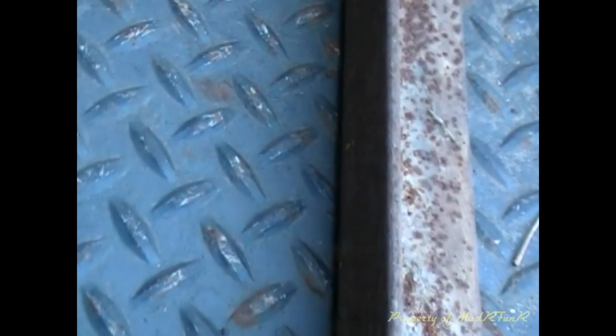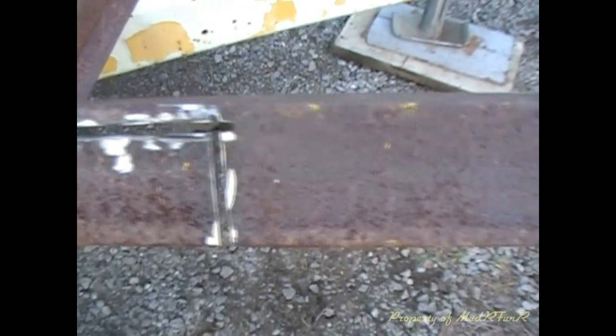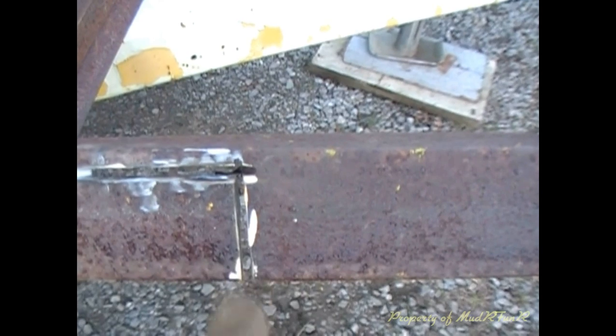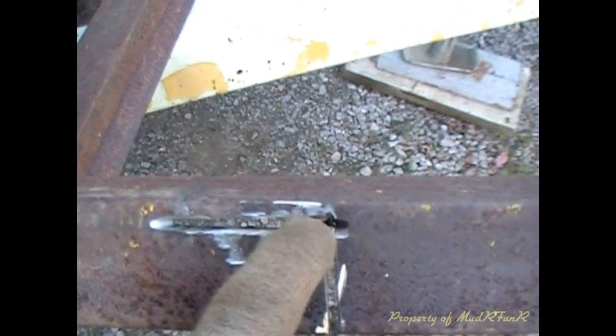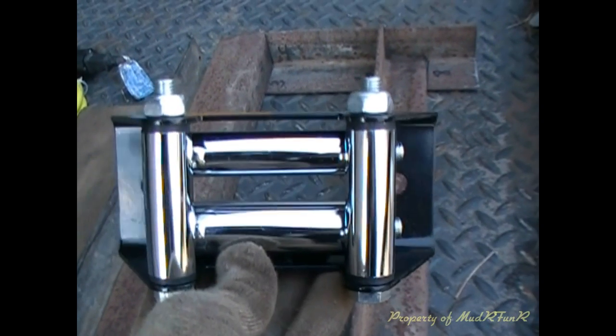That's what my frame is going to look like, and my flat plate is going to go on here. I need to put a brace up in between for a place to mount this roller guide. It was kind of an oddball shape, so I cut this end right here to four and three quarters — what I needed — and then cut it across this way. I wanted to keep this thickness here, and now I just need to grind that off. This piece is at six and three quarters and that'll sit right down in there nicely as a place for this to attach to.